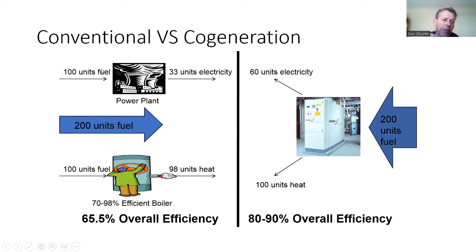With the solar panels, we don't have really high efficiency of conversion of sunlight. It helps make the grid more efficient when the sun is shining, of course. But even if we're using natural gas only for these applications, from a North American standpoint, typically we're going to be lucky to have 33 units of this fuel end up at the light socket. In fact, more commonly, you're going to be somewhere around 23%. So that conventional way of doing things, apples for apples, you're going to be lucky if you're at 65, 66% overall efficiency. And really good odds you're going to be below that for these reasons.